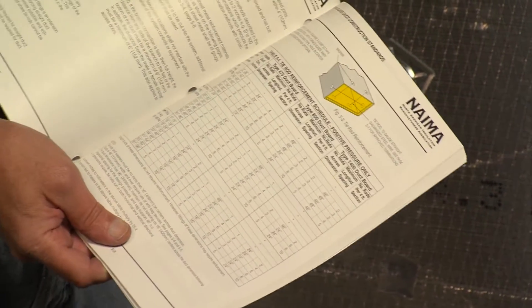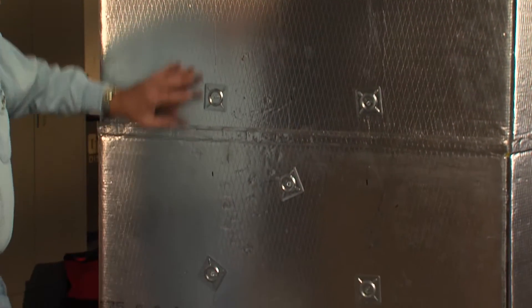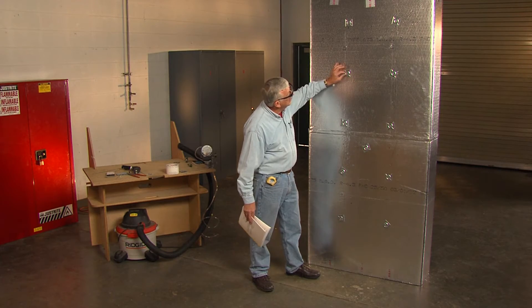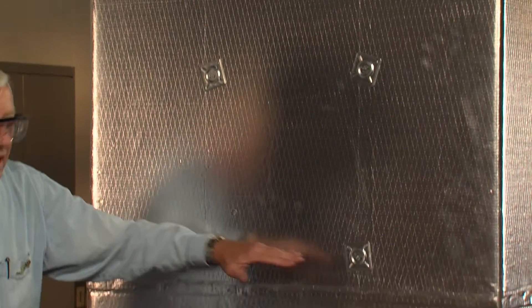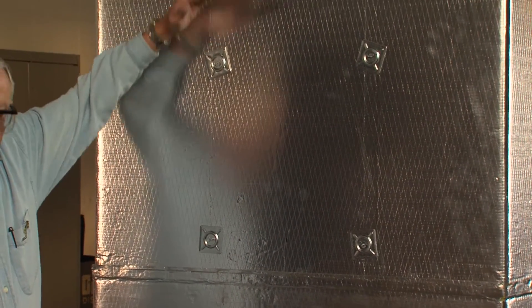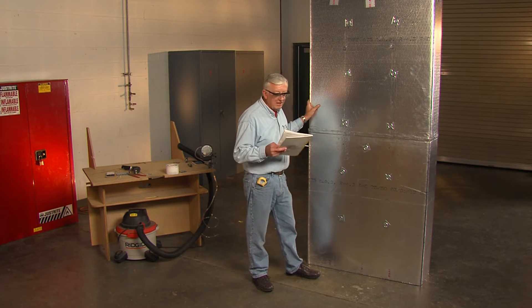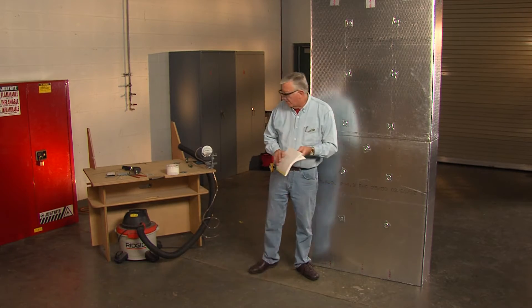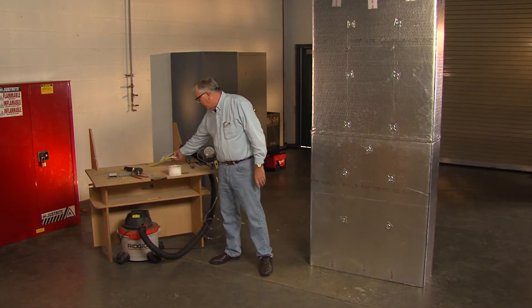In this particular case we have to put in six rods here. I don't need the next rod because I have the end cap down there. These rods for this size duct go 16 inches across the duct and 16 inches down the duct — that would be the reinforcement. The scheduling is in the manual, and the alternate termination methods are in the manual also.